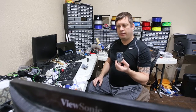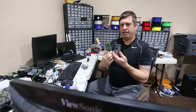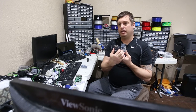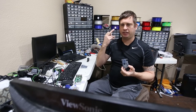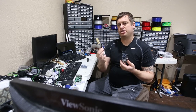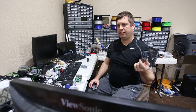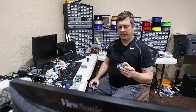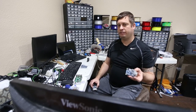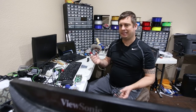Just for kicks and giggles, this is an Orange Pi 1 and this is an Orange Pi 1 in its case. So if you want to see the differences: this is a Raspberry Pi, an Orange Pi 1, and then an Orange Pi Zero — you can see how much smaller these devices are. I apologize, the camera got autofocus on my face so these are a little out of focus, but I just want you to see this is much smaller. This actually has more processing power, does 4K video, has HDMI built in, and is compatible with the Raspberry Pi camera. The Zero, on the other hand, has Wi-Fi built in, so it's great for embedded devices where you need Wi-Fi.